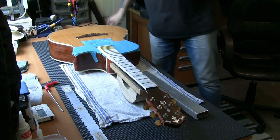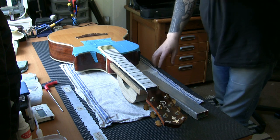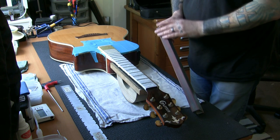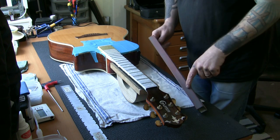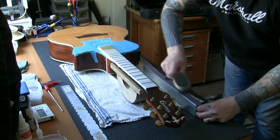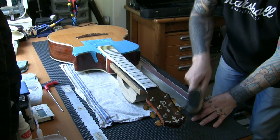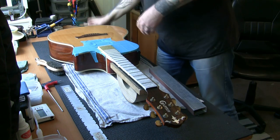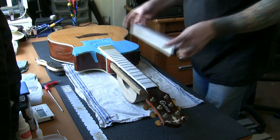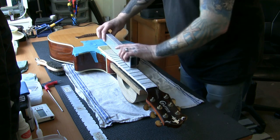Cracking on with the fret level. I've got the guitar where I want it, with an old tile underneath to catch any filings so I don't scratch my setup mat. I haven't changed the paper on the leveling beam — it should give me four or five levels and I've only had a couple of uses. You can brush these to remove filings and get a better cut. This is 240 grit. I've put fresh green pen on the tops of the frets.